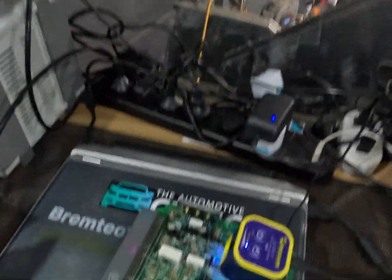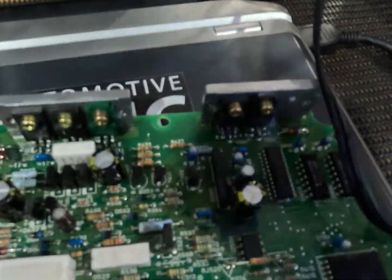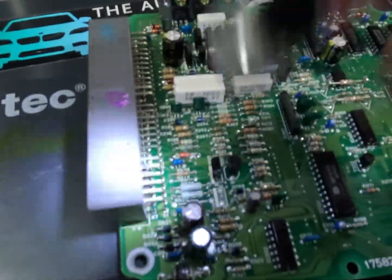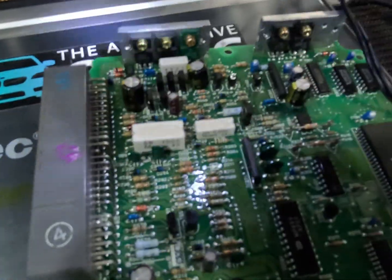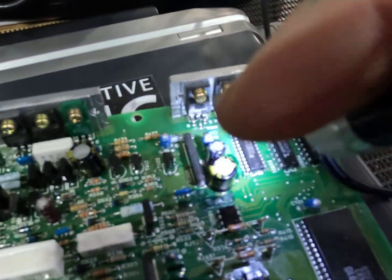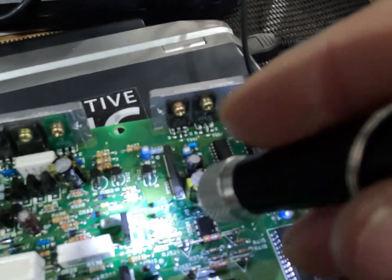Alright, so our Toyota Prado ECU is all done. We've just got some UV mask drying under the light. I'll get the proper torch out so we'll show. All new caps. I am waiting on a couple for here, but these two aren't leaking at the minute, so that should be fine to just send back and we can replace them later. The main damage over here is all repaired, so we fixed one buggered trace. It was just bent at the end.